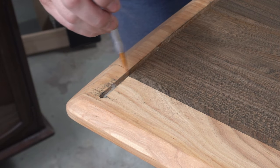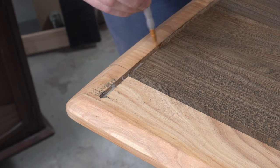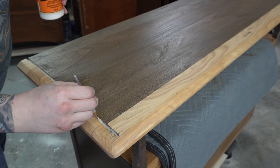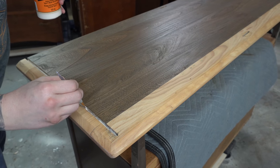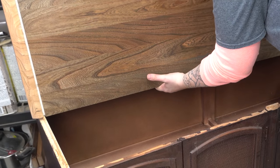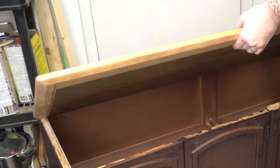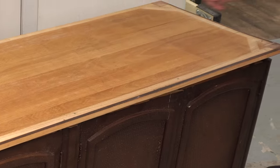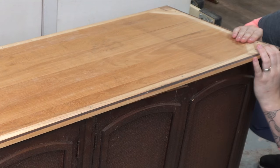This is now ready to have the cabinet put back on. I'm putting glue in all of these slots — there are no screws to hold this whole bottom section to the main part of the cabinet, it's all from these grooves and glue. I wanted to make sure the glue was good. There's no way I can completely fix these warped boards.